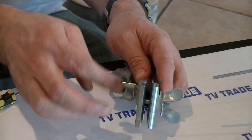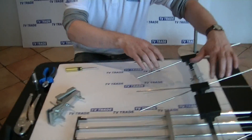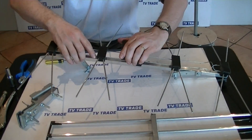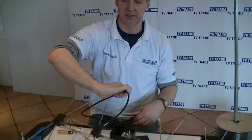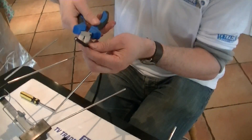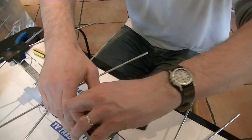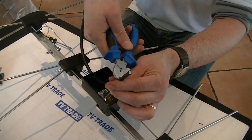I'm not going to tighten it all the way and I'll show you why in a moment. The next thing to do is wire up the dipole here. I'm going to pull off this cap and I have a length of coaxial cable. I pick up the snips, and actually what I'm going to do first is feed the cable directly through here. This is quite a snug fit, so it's best to feed the cable through and then pare it down.